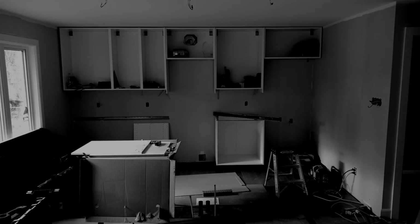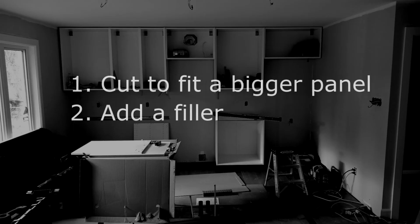Well, you normally have one out of three options. If it's just a tiny gap, you can always use some caulk, and I did not put that on the list because that is quite obvious. If you have a big gap, more than 1/8 of an inch, I would say, then I would consider either using a panel one size bigger, and maybe that's not even possible unless you go to IKEA and pick one up, because when you create the layout plan, you don't take into consideration that your walls are how they are, and that means you may not have that panel at hand at all.